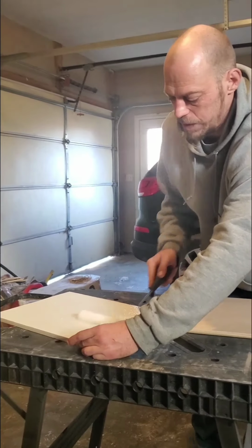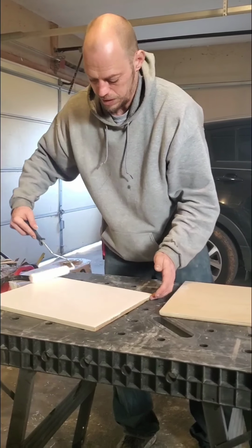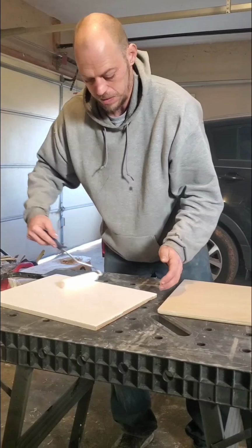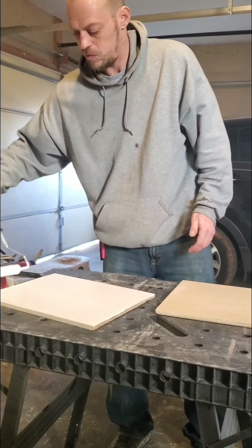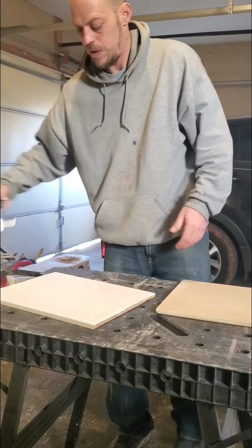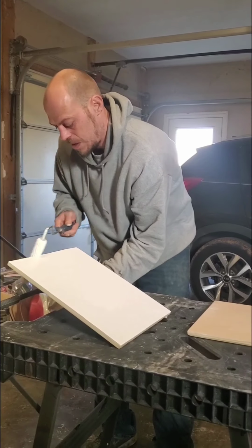So once you get it applied and everything looks really good and situated, then you just want to go ahead and kind of leave it alone, because this is one of those paints, once it starts to take effect and starts the drying process, if you go back in and try to touch it, you're actually going to cause bad spots in the paint, and you'll have to wait, let that dry, sand it out, and then fix all that.